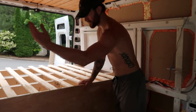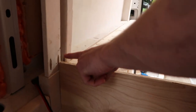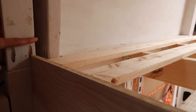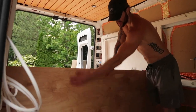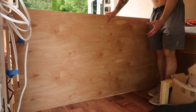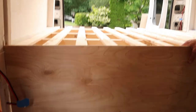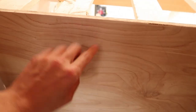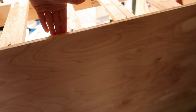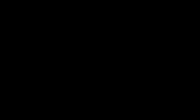We have the face of our bed cut out. As you can see it barely comes up over these slats, so we are definitely going to need that. The counters are going to come up to right about here, which will make sure our mattress doesn't slide out. Now that we have this here, the kitchen galley and everything is going to be on this side, and the vanity and couch is going to be on this side. We are going to soft-place those so we know exactly where they will sit. Right here in this middle area we are going to have a little cutout, and we are mounting this by screwing it from this end into the 2x4 we have for the bed, and on the inside from the garage side we are going to have 2x2s going up to kind of frame it.